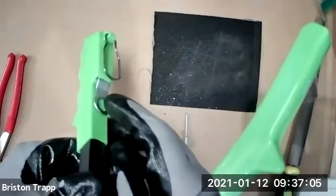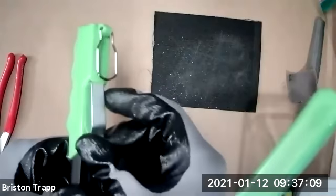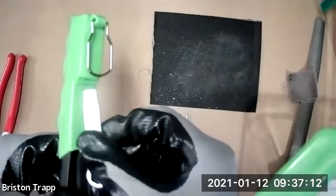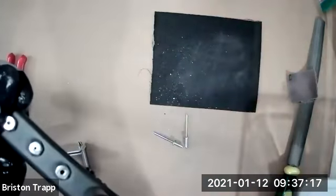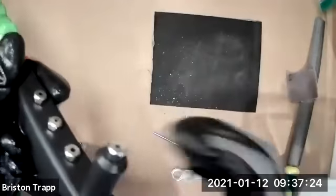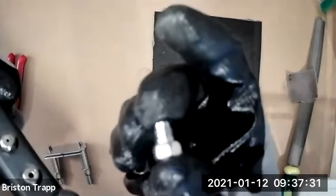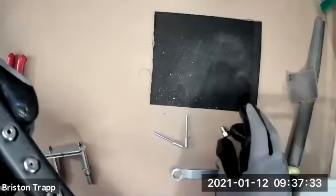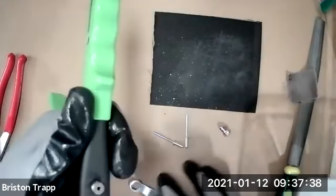In the handle of your pop rivet squeeze, there's a little wrench. You need to take out that wrench, and take out the nose piece for the 1/8 inch rivet. This is the one that we'll probably use a lot. So you unscrew it. I'm going to set it down and then unscrew the one that fits the bigger rivet.